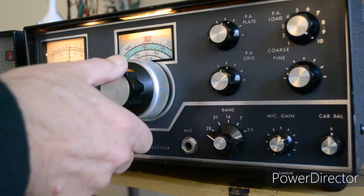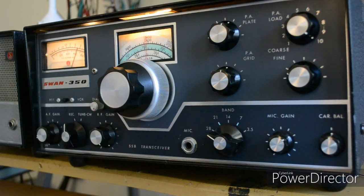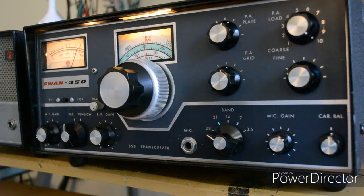Out of the transistor it was minus 8, and it's still supposed to be minus 10. So here's what I figured: I disconnected it and took a 9-volt battery and hooked that up instead. And the frequency didn't change when I transmitted — it stayed right on frequency when I transmitted.